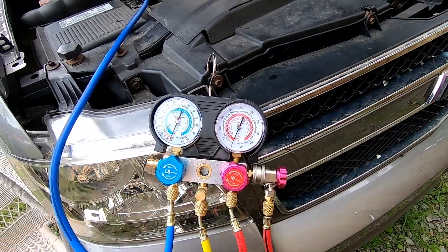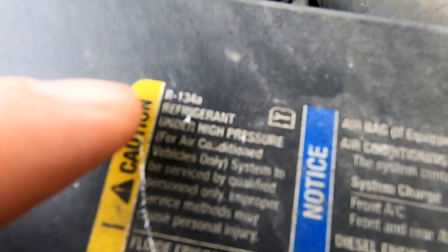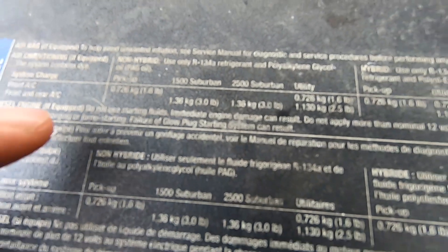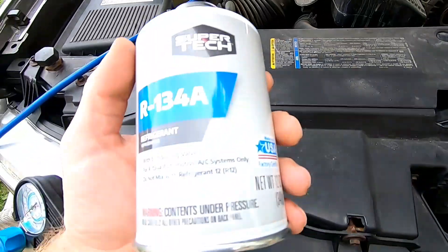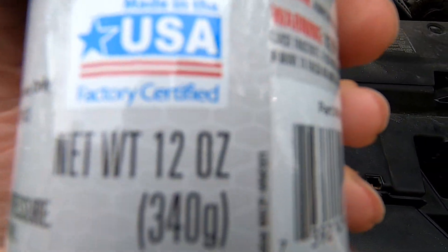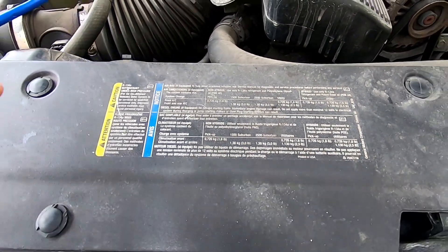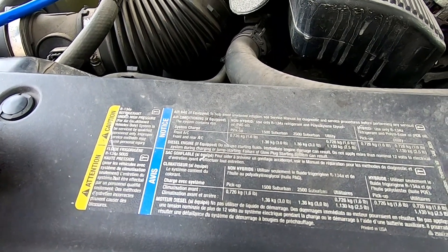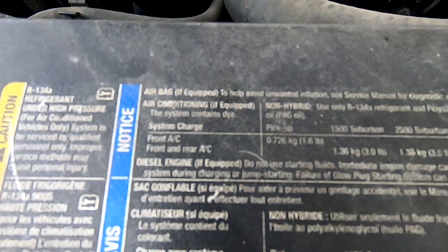To see where you're at, we can look at our vehicle — this is also another way. Our R134a sticker actually tells you how much it holds; this one says it holds three pounds. So we know we need four cans of 134a, because these are 12-ounce cans, so that'll give us 48 ounces which equals three pounds. If you ever have an issue figuring out how much refrigerant to put in, it's right here on your vehicle. It'll tell you your oil and your R134a amount.